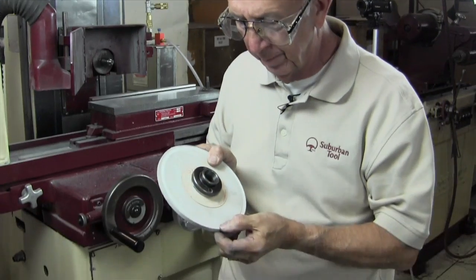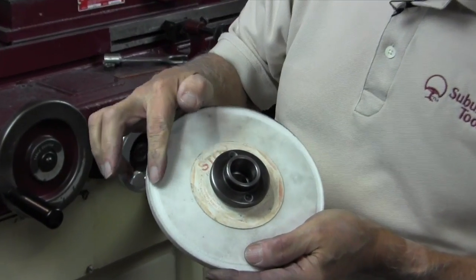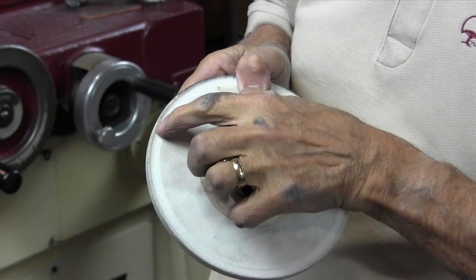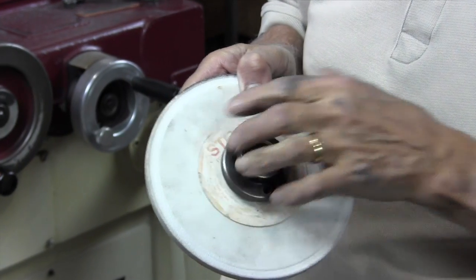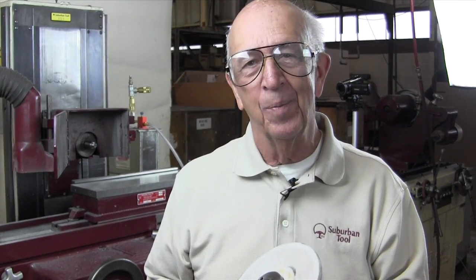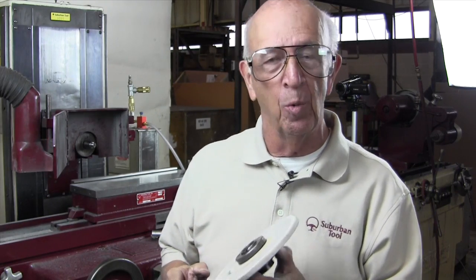Alright, can we get a close-up here? You can kind of see how I dished it out and brought it to a point on both sides. So that's how we side wheel — that's how we can grind a slot by using a 60J wheel. We think this is the type of wheel to use because of the degree of hardness. Get it too hard and it won't break down; get it too soft and it will break down too much — so it depends on the application and the type of steel. But this is the kind of wheel we chose for this particular job. Thanks for watching.